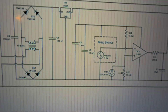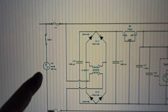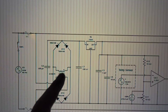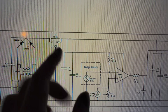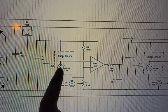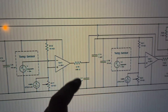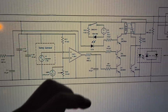I'll start at the beginning. So here's our wall power — we rectify that, and first I have an isolation transformer. We regulate it down to about five volts, so everything past here is five volts. This is a temp sensor in a comparator circuit. If the temp sensor goes past 100 degrees Fahrenheit it trips a BJT, and there's another one for redundancy.